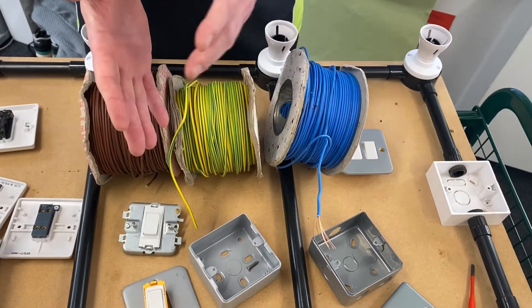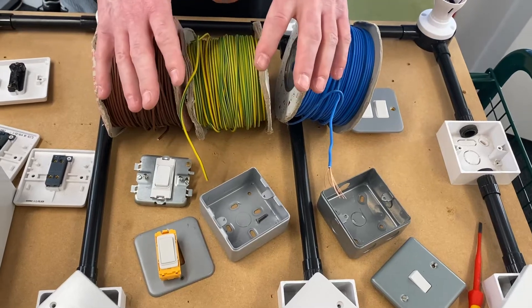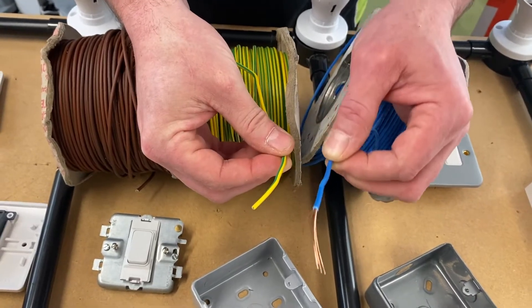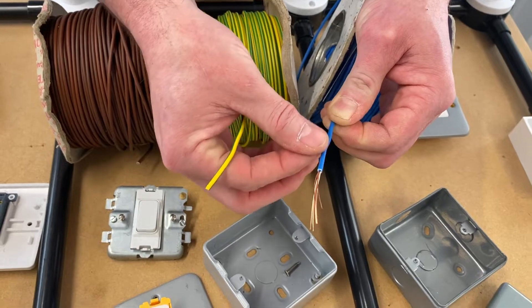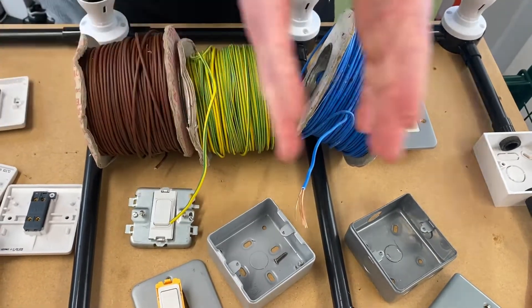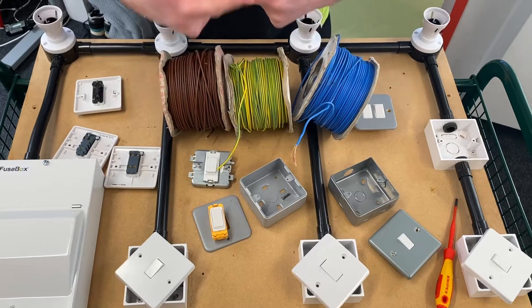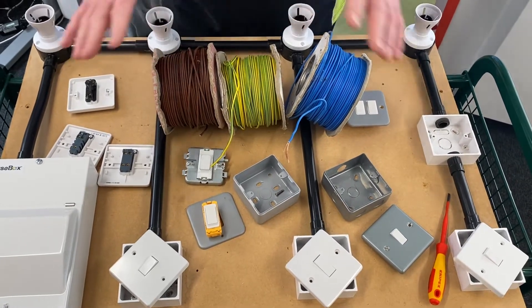We're not going to attach cables to a nylon draw-through tape; we might even start pushing cables in one at a time as we follow our wiring diagram. In the real world, that's not great practice — you'd like to pull all your conductors into a location at the same time because it's considerably quicker. You also have to remember that when conductors pass each other in a conduit system, the rubbing causes friction that can work its way through the PVC outer. But this rig is all about learning where the cables need to go in order to wire a circuit.